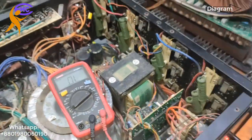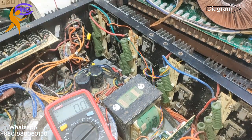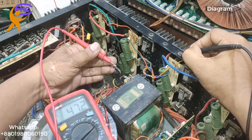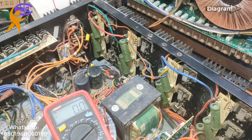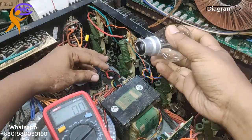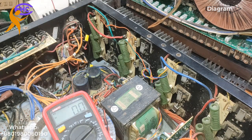The second six transistors — this side — we need to check. I am checking the voltage first: 47 volts. This amplifier runs with 47 volts. I am discharging the voltage now. We need to discharge the voltage — the transformer body is negative and the positive is the red wire. The voltage is discharged. Now we need to check the transistor.